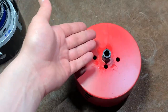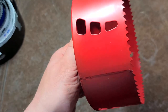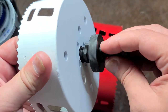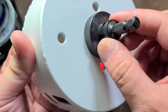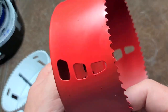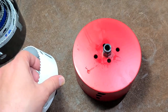I suppose if you're doing a downward action or maybe right overhead, you could use a set of socket adapters. I do have one of the Bosch quick-release hole saw drive adapters, but it's still annoying that they're now integrating that into the hole saw. The standard for driving hole saws is a half-inch drive, two-pin hole saw adapter that threads in and uses two pins driven by a couple of flats. That's what most people are going to have, so if somebody picks one of these up off the shelf and doesn't notice, they'll realize too late that they need a special proprietary quick-lock adapter. They're trying to drive people towards that quick-lock adapter and away from well-established standards, which is frustrating.